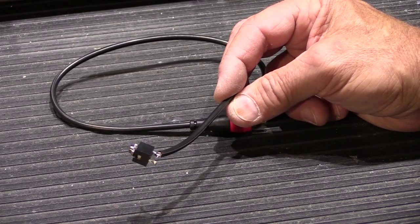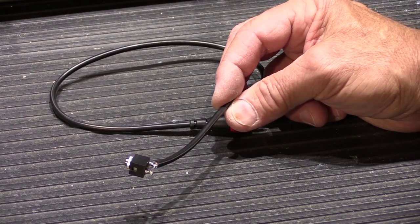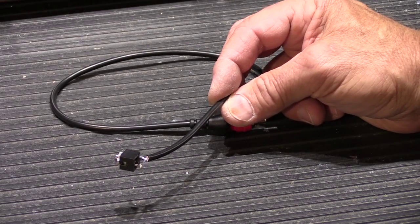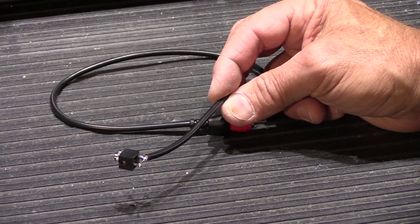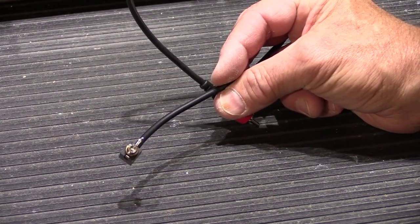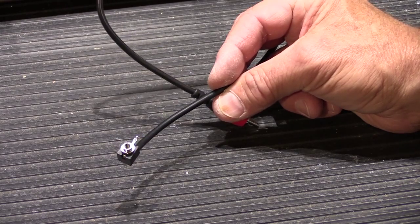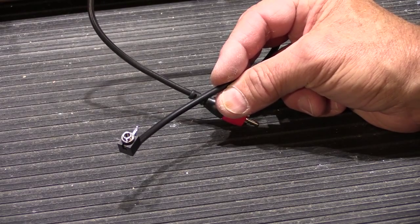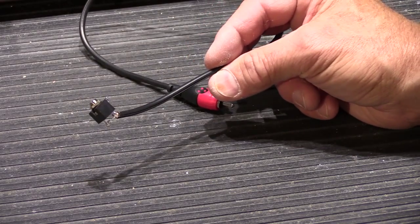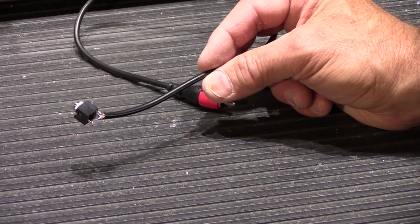The video about installing the audio jack, along with the video that shows how to use a Bluetooth receiver once you've installed the audio jack, are two most popular videos on our YouTube channel, but it really addresses how to do it on a more modern intercom system. The IMA4406 that's in that video would be vintage 2004 or so, and I have been contacted by people that want to do the same type of thing on an older intercom system, and that's what I'm going to show you how to do today. So this is the subject of it, and we're going to install it on a system that was made in the 70s. So let's go ahead and take a look at what that is.